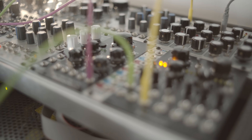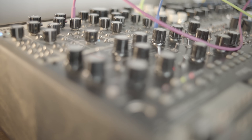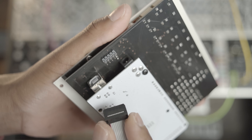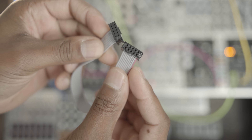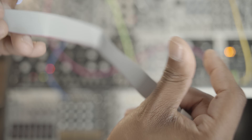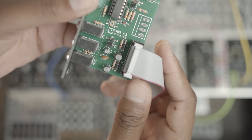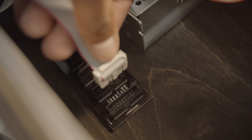Now it's time to install your modules. During the module selection process, you'll probably have picked up many different modules with many different power supply connectors. Some might have 16-pin connectors and some might have 10-pin connectors. You'll want to make sure that you attach the corresponding pins on each end of the Eurorack connector cable. Usually you'll see a red strip or dot on your unit indicating the minus 12V pins. You need to make sure that the minus 12V pin on your power supply and the minus 12V pin on your module is connected. Usually the cable has a red line along one of the sides, which is easier to match up.